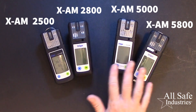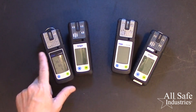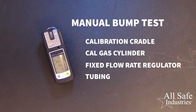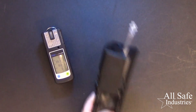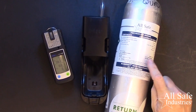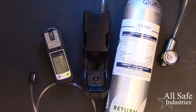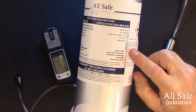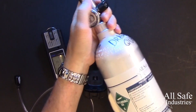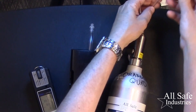These are the four gas meter versions and these are the multi-gas meter versions, with the biggest difference between these being the sensor options and the price points. Now that this meter is ready, let's perform a manual bump test. This is the simplest and most cost-effective method. You'll need the following accessories: a calibration cradle, a cylinder of calibration gas with the factory standard values, a fixed flow rate regulator, and tubing to connect to the calibration cradle. Be sure to check the expiration date on the cylinder of calibration gas, and when you engage the regulator, check the gauge to ensure there's still gas in the cylinder. Finally, connect the tubing from the regulator to the calibration cradle.